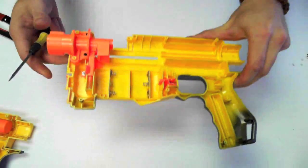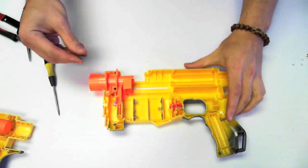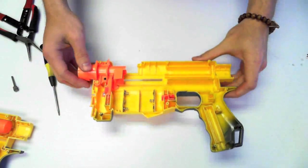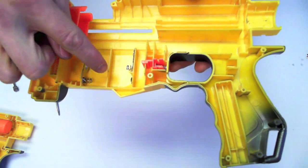When you're done, it should look something like this. Once the epoxy dries, use the high-speed cutter to grind down the edges of the leads so they're flush with the magazine guides. Then to fit the batteries, use the high-speed cutter to remove three semi-circular segments from the middle magazine guide. This will hold your batteries in place.